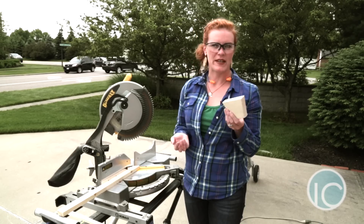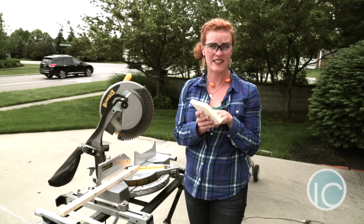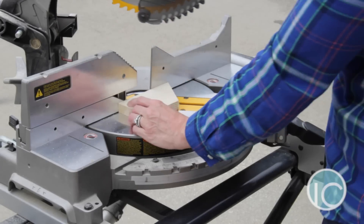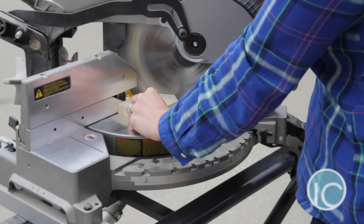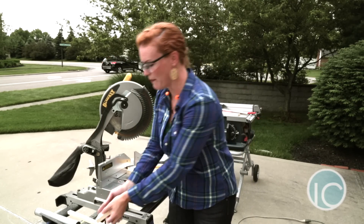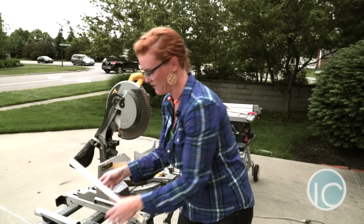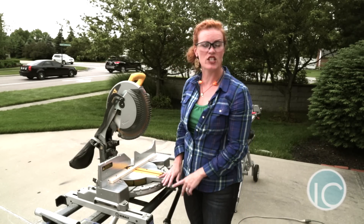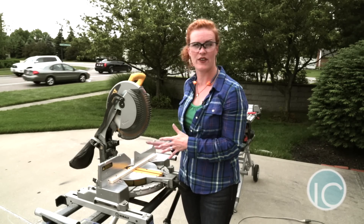Now I just have this scrap piece of wood, also cut at a 35 degree angle, and I'm going to go ahead and cut the point of the arrow with this. I'm going to keep it at the same 35 degree angle — that looks about right of where I'm going to cut it. Now I have my point and the tail, and for the middle piece I'm just going to guess about how long I want the arrow to be. Before I cut it I had to change my saw to make sure that I'm cutting at a zero degree angle and not a 35 degree angle anymore.